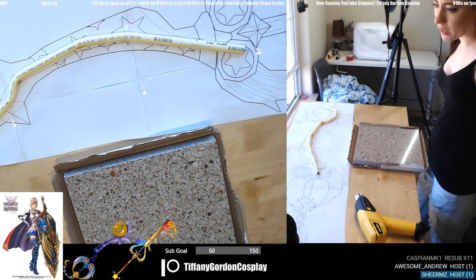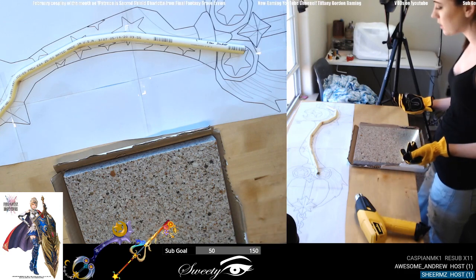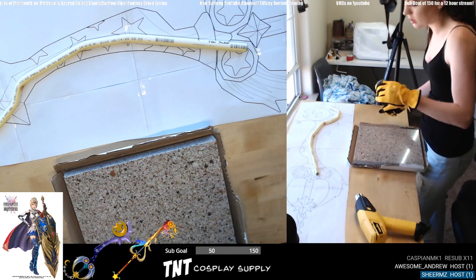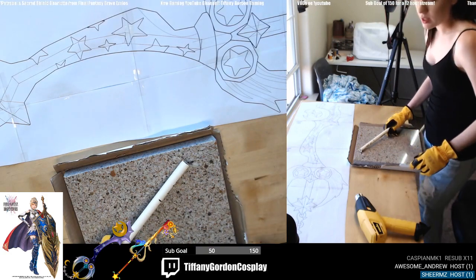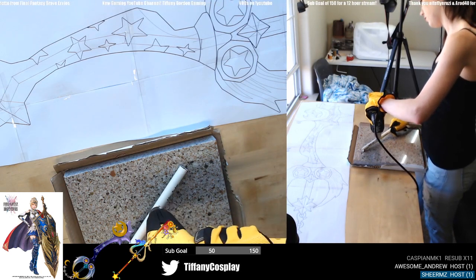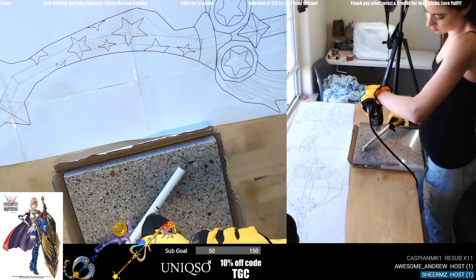So this isn't PVC pipe, it's CPVC. So different material. The PVC pipe is a lot harder to bend and it cracks a lot easier. The CPVC pipe is yellow and it doesn't take too long. I mean, it's still kind of hot, but it'll stick in place. So yeah. And then the last one. It's still hot to the touch with the gloves on where I adjusted it, but it's hardened. And the first one you do always takes the longest to heat up, just because you gotta slowly work the heat down in one direction.